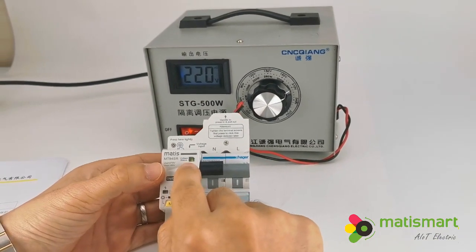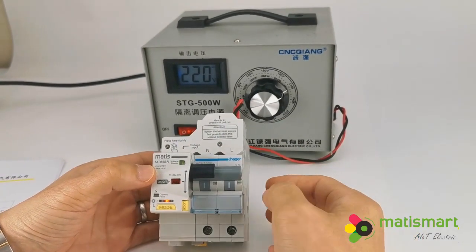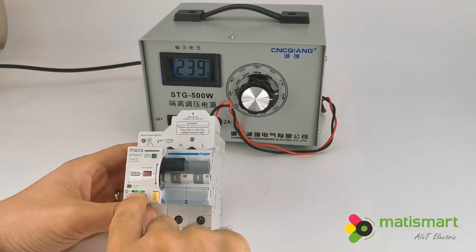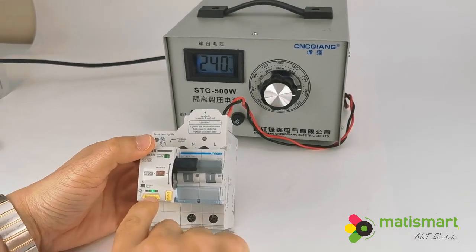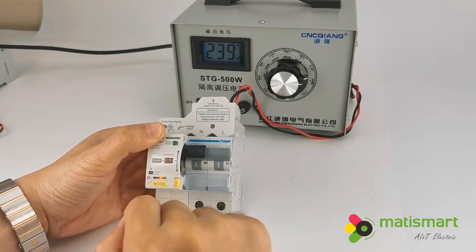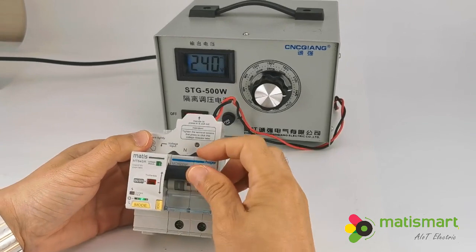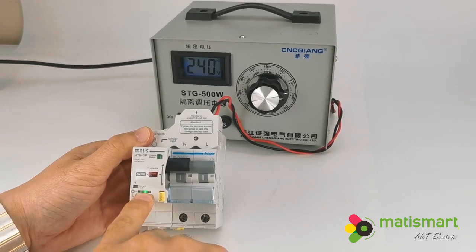Now is the charging point — it will take a few seconds to make sure the auto reclose is stable and confirmed. This covers voltage protection and current fault. When the mode light is green, it means all voltage and remote functions are active. When we press this button for about 4 seconds, it changes to alternating green and red — this is manual mode, meaning all remote functions are disabled and only manual operation is possible.